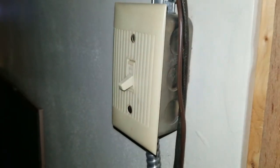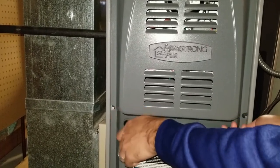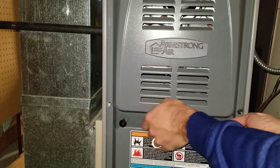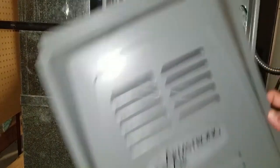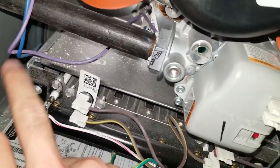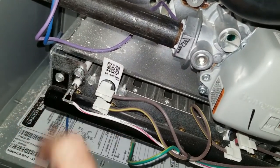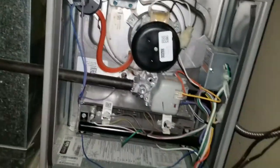So let's go over to the furnace. Before you do anything, flip the switch off — that is the electric switch for my furnace — and then we'll get you set up here. Unscrew these, take that off, get it out of the way. Now my particular flame sensor is this guy right here, and that's the little bolt we got to take out. It's a quarter inch.